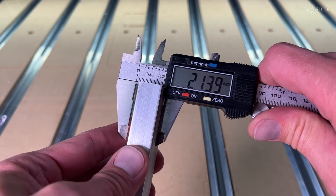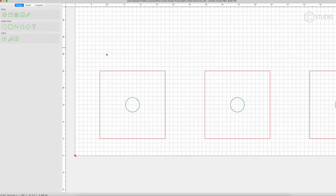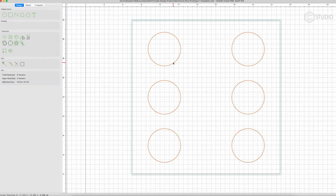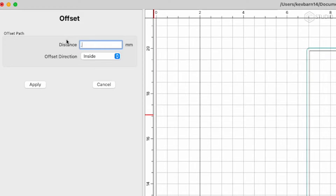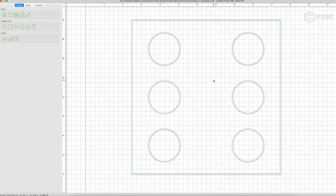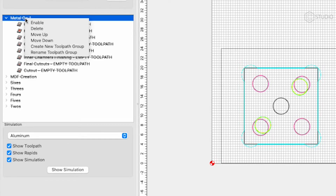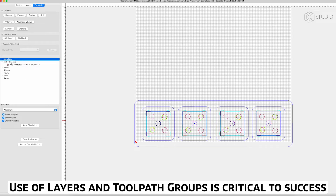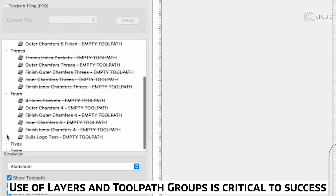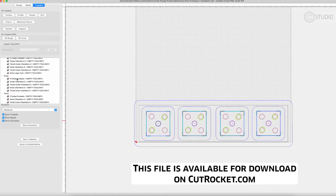One huge point here: make sure you measure your stock accurately and put that number in. It's doubly critical here because it's going to match the size of the boxes we're creating. I constructed a series of boxes exactly the same size as the thickness of my material, and the thickness is defined in the job setup. I then laid out my number dots big enough to use a 1/8 inch end mill. With those successfully laid out, I did a 0.1 offset to the outside of the boxes and to the inside of the numbers, so I can set up two different chamfer paths — because everything needs chamfers, particularly dice. Then I set up an initial cutout, the chamfers, the rest of the cutout, and a whole bunch of different tool path groups for the sides.